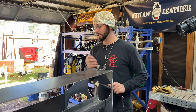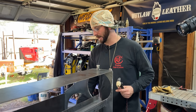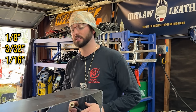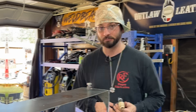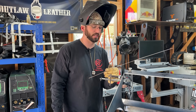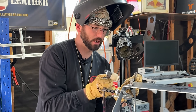All these things to consider when doing this technique: what metal you're welding on, the thickness that you have, and what wire thickness you have. Today we're going to go over a couple of examples using 1/8", 3/32", and 1/16" wire as we do the dab and dip technique. We're going to start with the 3/32" TIG wire — this is probably the wire I would choose to weld something this thickness.